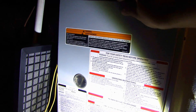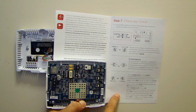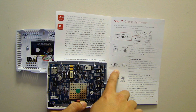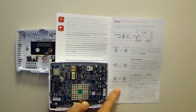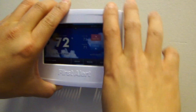Now put the cover back on. Before you install the front face plate onto the back plate, pay attention to the dip switch on the circuit board, referred to on page 10. The first switch selects gas, electric, or heat pump. The second (middle) switch is for the heat pump setting. The third switch controls the fan function — selecting gas lets the HVAC control the fan, while selecting electric means the fan comes on when heating is energized. When installing the front face plate, keep in mind that the pins get inserted into the barrier strip, so be careful not to damage them.